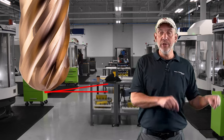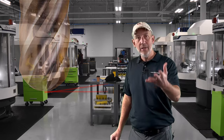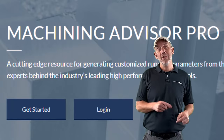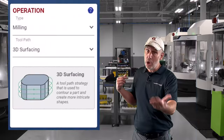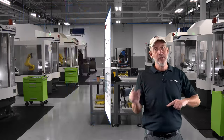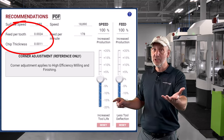What's the formula to adjust for chip thinning? I'm going to make it easy on you. Please go to Machining Advisor Pro — it's a free download. Download Machining Advisor Pro and it calculates for chip thinning on a ball nose end mill. You put a ball nose end mill in there, it knows you're doing surfacing, and it makes your calculation on effective diameter and chip thinning so you get the benefits of the feed. That's the easiest way to do it. That's how chip thinning works on a ball nose end mill.